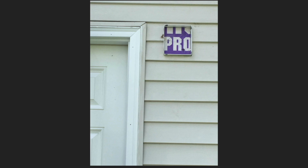For the electrical, I wanted a light by the man door. There had been a couple of spotlights that just shone all over the lawn, but I wanted something that was just kind of there at the door. So I took out the one that was over the door and put one in the corner. Ended up putting it on a neat timer switch — you put in your latitude and longitude and the time and date, and then you can have it turn the light on and off relative to sunrise and sunset. It'll just calculate throughout the year when sunrise and sunset are with a little computer it's got in there. It doesn't need to be on the internet or anything. I ended up putting in a couple of those at home too for the porch light and the garage light.